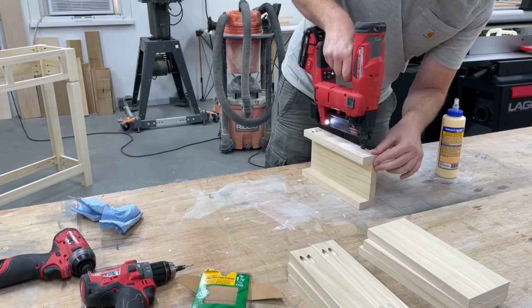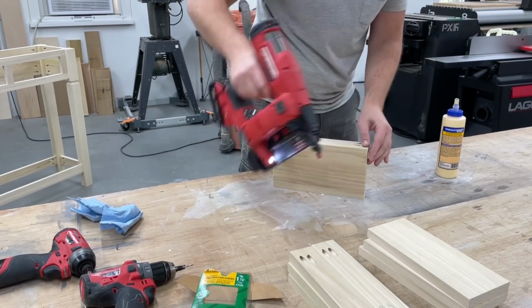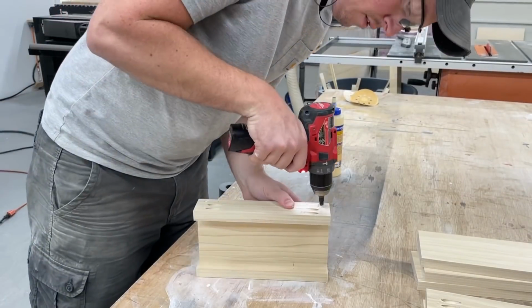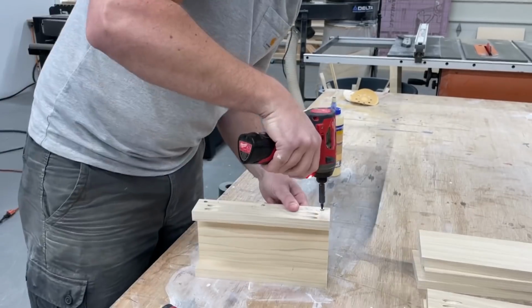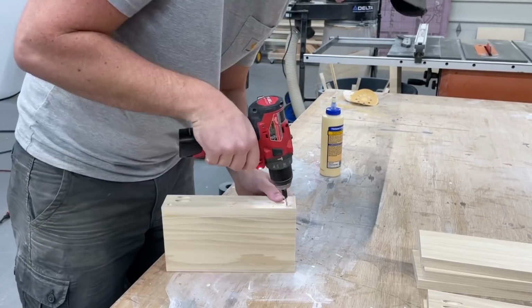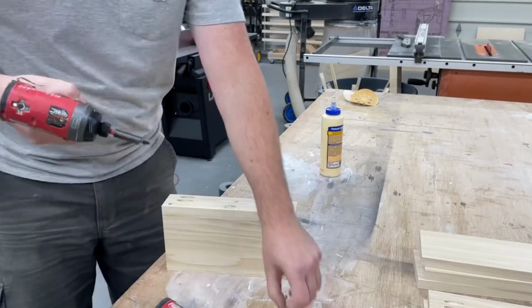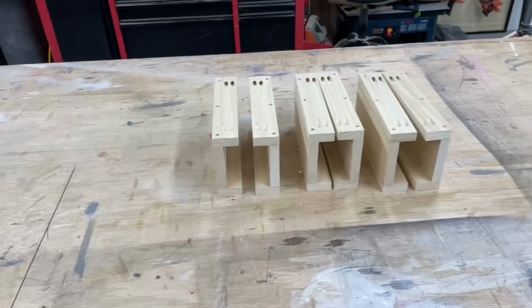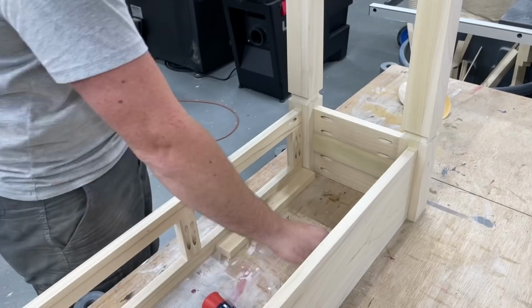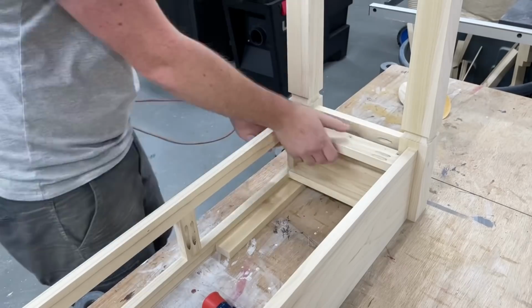With how small the drawers are and just a classic feel of the build overall, I felt some traditional wood runners would fit a lot better than some store-bought metal slides that would eat up several inches of space. The runners are just 3 pieces glued and screwed in the shape of a U. The drawer will slide on the bottom piece, the top piece will keep the drawer from tilting up, and then the middle piece will keep the drawer from racking side to side.